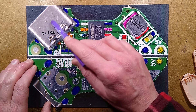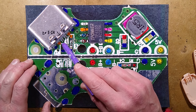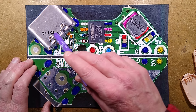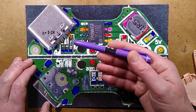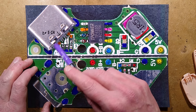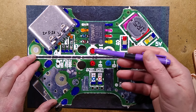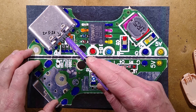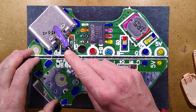Here is the USB-C charging port, and it has the two 5.1K resistors connected to CC1 and CC2 that signal to whatever device it's plugged into that it's looking for current. That's really good — a lot of stuff just misses those off, and that results in things like rechargeable head torches that just don't work if plugged into some power banks. In this case, it does send the correct signal back.